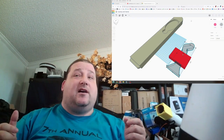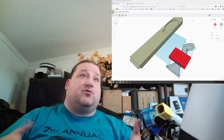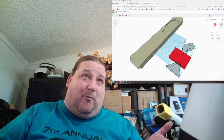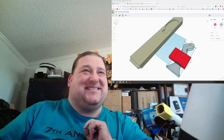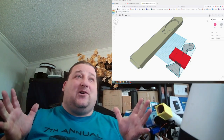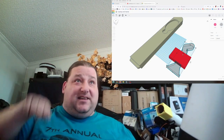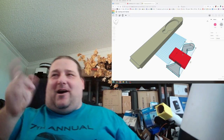One metal insert is usually enough, but I can put two pieces in if I want. If you have an unusually hard-to-turn key you might want to double it, because if you break it it's going to cost you 1.5 cents to print another one. It takes about seven minutes to print — even FDM printing takes about four times longer to heat the printer up than to actually print the key. I even print my own key head and insert this into it.